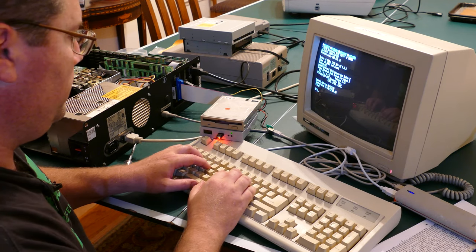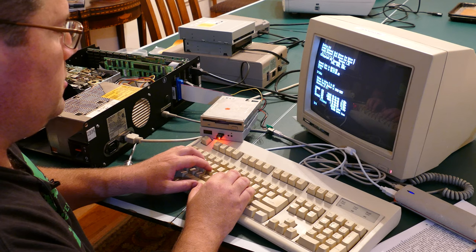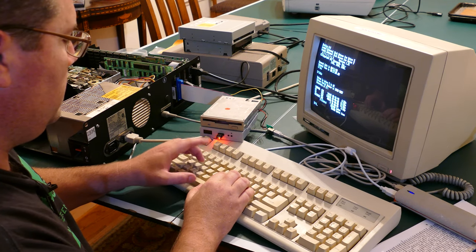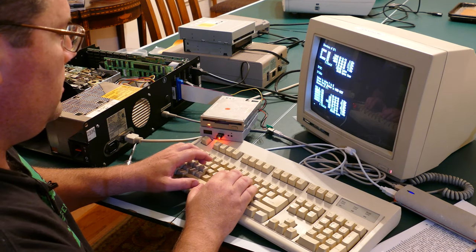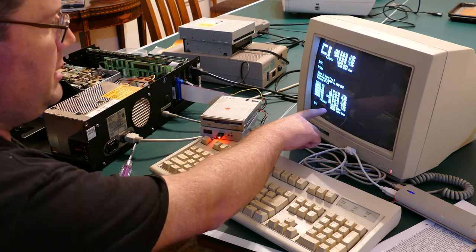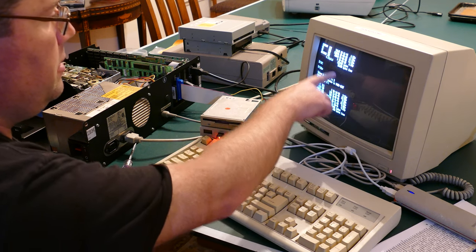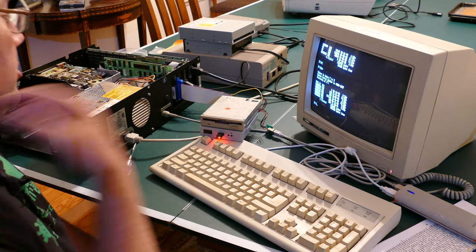I have thoroughly tested the cable again — everything's connected now, and I've got both drives connected here. I've got the 1.44 megabyte drive with a 720k formatted disk — it's a 1.44 meg drive with the hole taped off, which makes it 720k once you format it that way. And I've got a 360k disk image mounted on the GoTek. So if everything worked okay, we should be able to go to E and see the GoTek, and go to F and see the real floppy drive. Oh, that's much better. DIR — and great, we can definitely see files on here. CM, I believe, is Chess Master 2000.